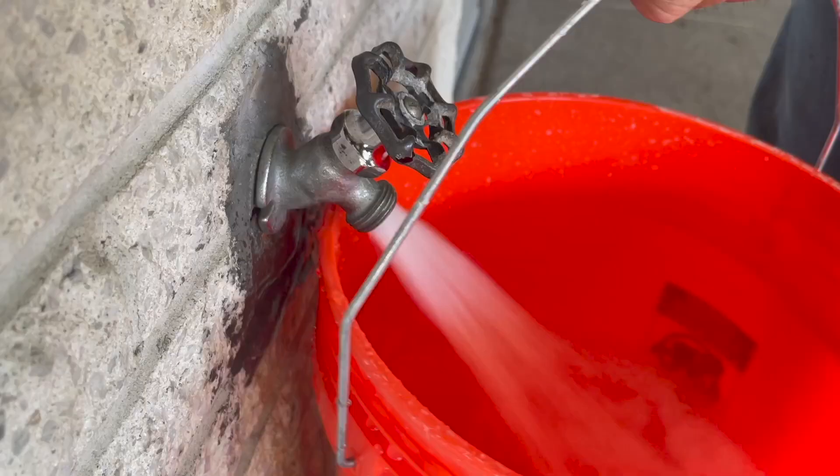When Tom orders tile, he basically just gets shipping containers worth of this stuff — we're talking like 90, 100,000 square foot jobs. Pretty impressive. Alex is noticing we're running short on water because we're spilling a bunch of it. If we have proper water level during the cut, we can get like 5,000 square feet out of this blade. But if it starts to run out and dry, this thing will burn right up. So we're going to go get some water.